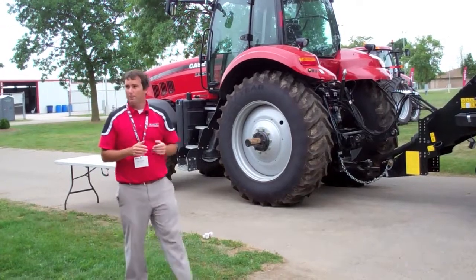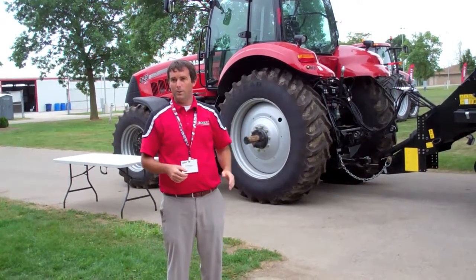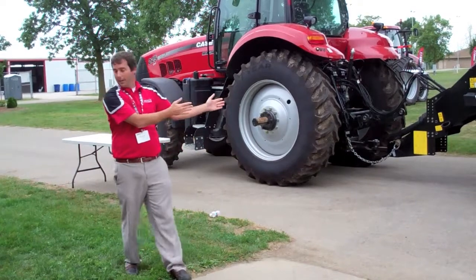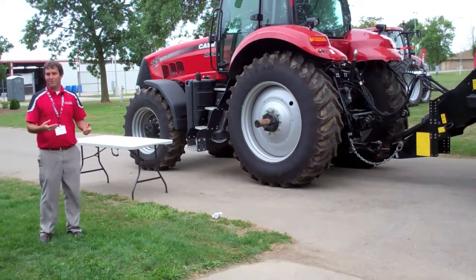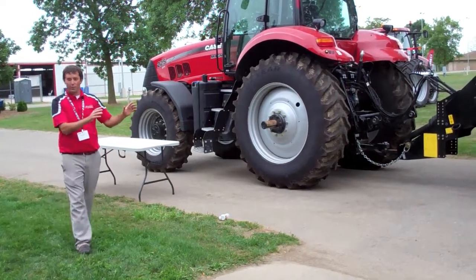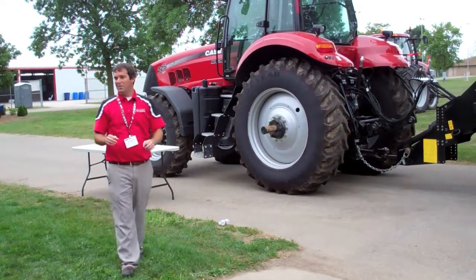We talked a little bit about reliability, uptime. Where's the highest wear area of a baler? The highest wear is going to be here in the pickup. It's running on the ground, running in the dirt sometimes, bouncing up and down. So we totally redesigned the frame, so it's a lot heavier duty. Even the pickup reel, the teeth, the guards, a lot heavier duty.